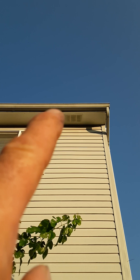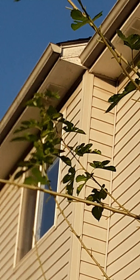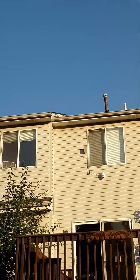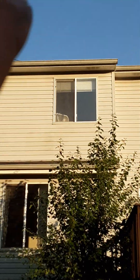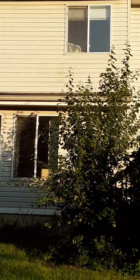Up here, remove the gutters, cover the fascia, cover these ends — they're getting rotten. That board's actually gone; when you get up above there it's missing — rotted about 90 percent. Take a look up there — see how it's rotted? That missing wood gets worse up there; that needs to be attended to right away, it could be a leak. So we'll take these gutters off, put fascia over, and then new gutters installed.